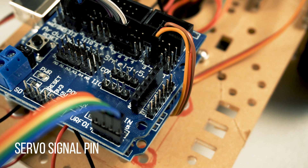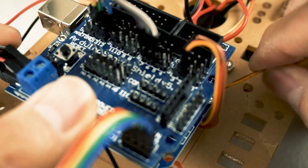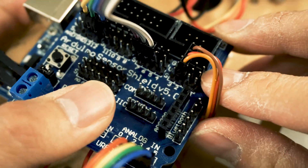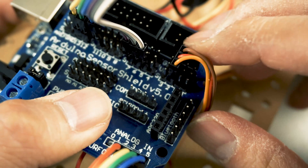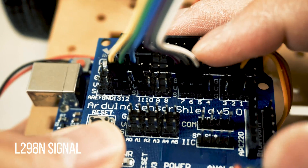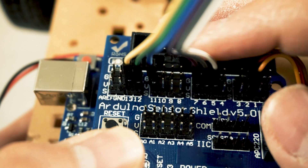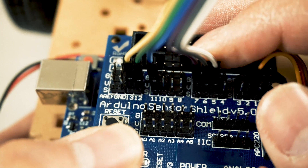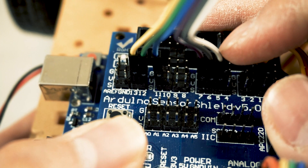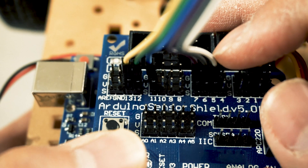Now let's talk about the electronic updates. During development of the code, I realized there were a couple of problems. The first one is the servo — we were using pin zero, but if you're trying to get the ultrasonic data through the serial monitor, you have to leave pins zero and one blank. So here we are moving the servo from pin zero to pin two. Another change is about the L298 pins. There was a conflict with the servo.h file — if you're going to use servo.h, pins nine and ten need to be left blank, or either your servo or your motor just won't work. To fix it, we'll move the pins 8 to 10 we were using last time to pins 11 to 13.